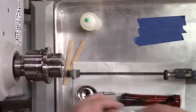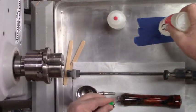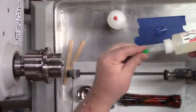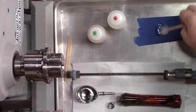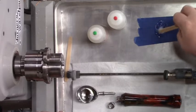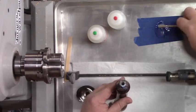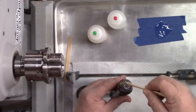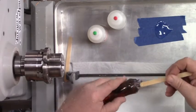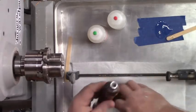Once you're done, you can take it out and it's on to assembly. I did a little bit of hand sanding right on the very end where the live center was, and that was it. I'm going to epoxy it together using five-minute Mercury epoxy, two-part — just mix it up. Mix up the epoxy, put some in the hole, put some around the tenon that you turned for the cap, and just put it all together. I used a clamp to hold it and left it for an hour or two, though you really only need about 20 minutes for the epoxy to be good and hard.